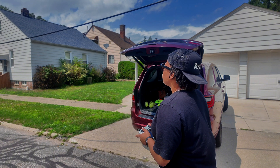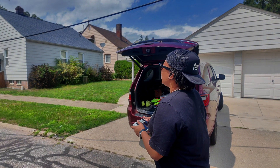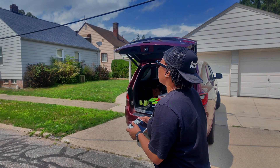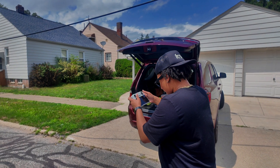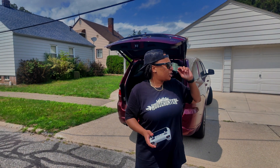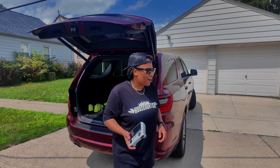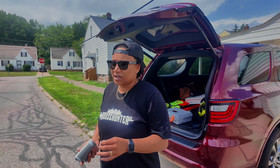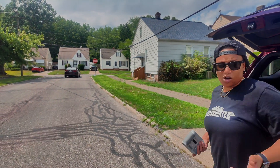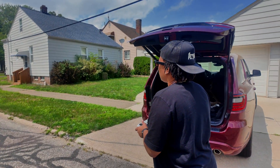I'm going to go to my roof drainage system, so I'm going to come to the gutters. I'm going to take a shot of the gutters in the front and also in the back. You want to get close so that you can make sure that the gutters are properly attached into the fascia and that they are slightly sloped away — that's what you're going to be looking for. And also obviously that they're free of debris.